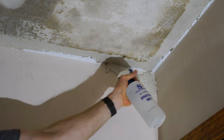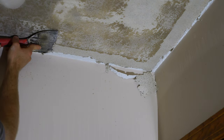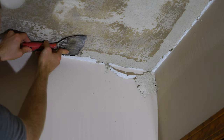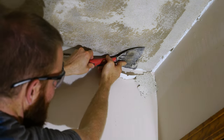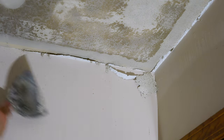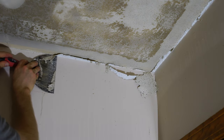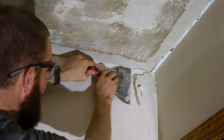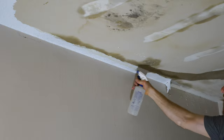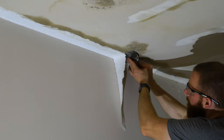When working around edges or corners of the wall, you'll want to work parallel to the wall and not perpendicular. That's because there's a tape joint, and if you work perpendicular your putty knife might get under the tape and rip that joint off. You can see the tape is a little bit yellower — using this parallel method will keep that tape joint intact.